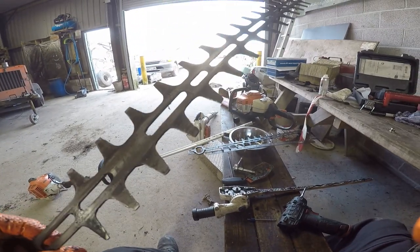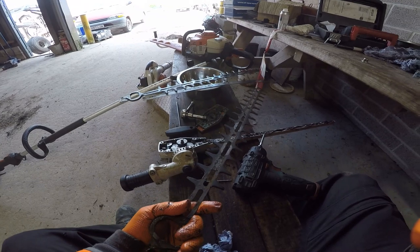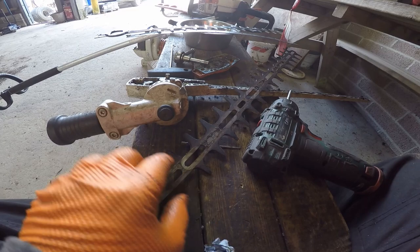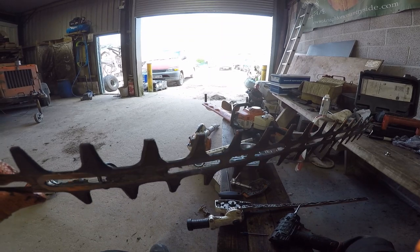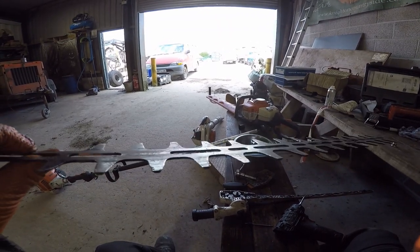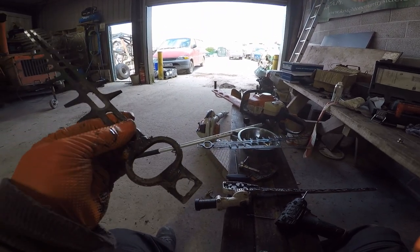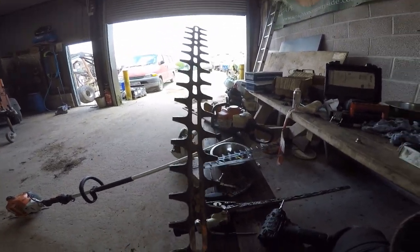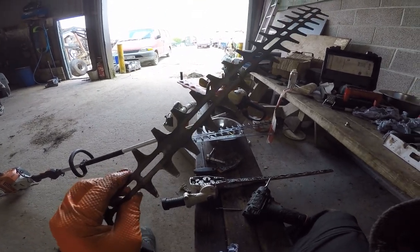Right, this is the blade. This is the top one, as it is when it's being used. You can see where it's rubbed on these bearing surfaces. Get the pattern of the washer. And if you look at these edges, you'll see that this would not have cut very well at all. Right, clean this off and set up, and I'll show you how I sharpen these. If you couldn't sharpen these, this would be time for another set of blades.